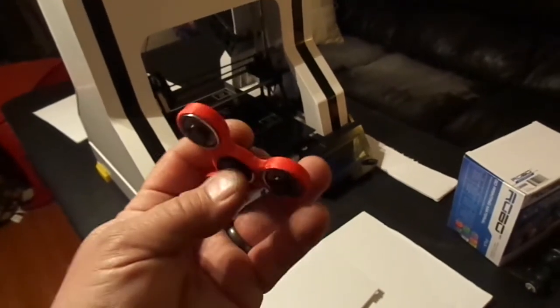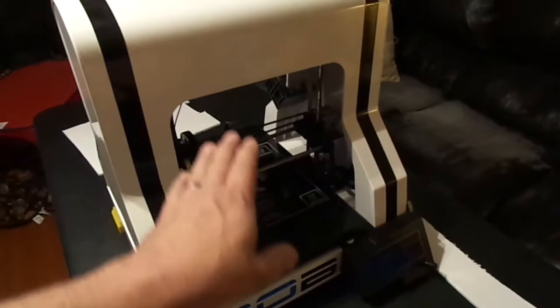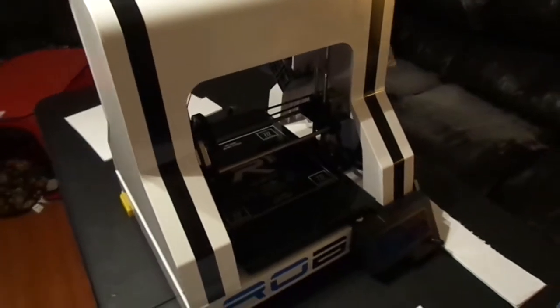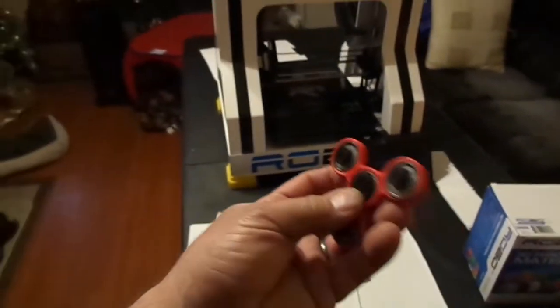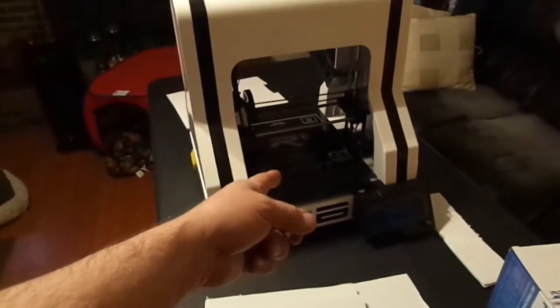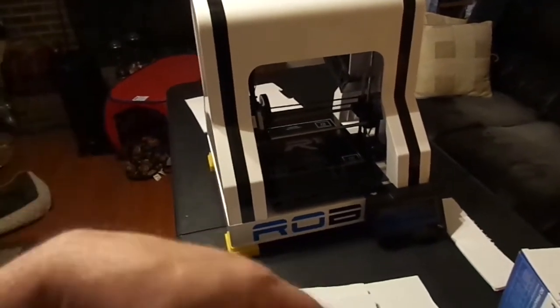When I was printing this little guy, everything failed — it would just pop off the raft and not stay on there. The current from the heat rising was pulling in cold air, cooling the part, causing shrinkage, and it was popping off. These prints were done with the fan off, with it on, with the brim, with the raft, 100-degree bed temperature, 250, 260 nozzle, 230 — I tried all kinds of temperatures. Everything fell into place when I blocked this off.